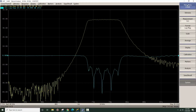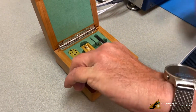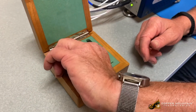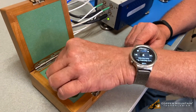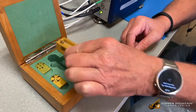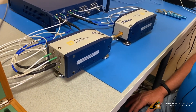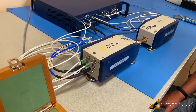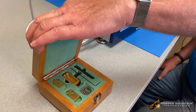Except we need calibration. To perform the calibration on this system, I used these pieces. There's a flush short, which I applied to ports one and two. There is an offset shim, which goes between the short and the waveguide on ports one and two — this gives you the open — and there's a broadband 50 ohm load that was applied to both ports one and two. For the through, I simply connected the two waveguides together and bolted them tightly. I performed an SOLT full two-port calibration on this system. I'm not going to show that now because attaching all these pieces is not very interesting and it's fairly time-consuming, so that calibration has already been done.